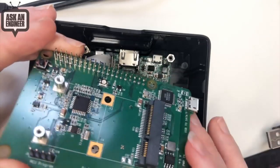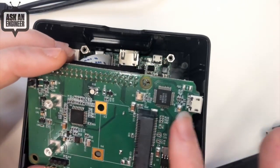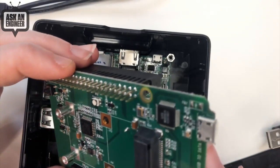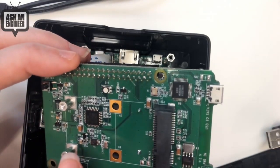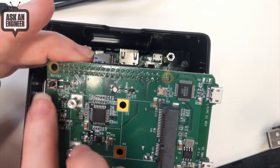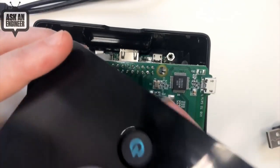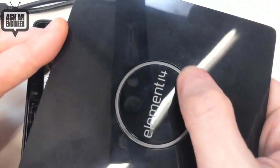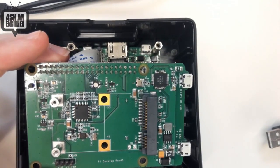If you don't want to use the microSD slot — maybe you want more storage or you don't want to worry about SD card corruption — you can get a SATA drive and plug that in. It's got a USB 2 to SATA converter, which isn't full speed but still pretty fast, and the Raspberry Pi is an incredibly fast computer. It's also got an STM8 microcontroller that's pre-programmed, which controls the button and the LED. It has firmware so it will properly shut down your Raspberry Pi, and there's a light pipe that glows at the top — you can see it's glowing blue, it looks really nice.